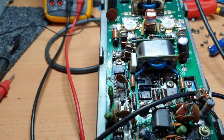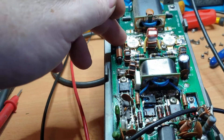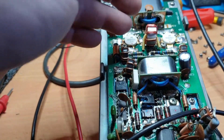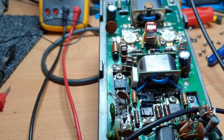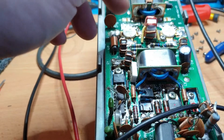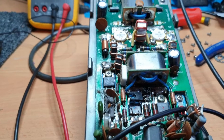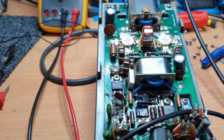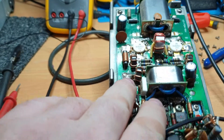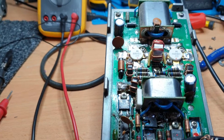Alright, 73s. I'm sorry we haven't actually got a finish on this one, but this is just a preliminary look. Remember — check these out of circuit, not like I just did with the in-circuit rough look. The fact that one looks very different from the other concerns me, but generally, pull them out of circuit and test them. Lift up the tabs on each one — certainly the two tabs. As long as you get the base and collector connections up, you'll be fine.